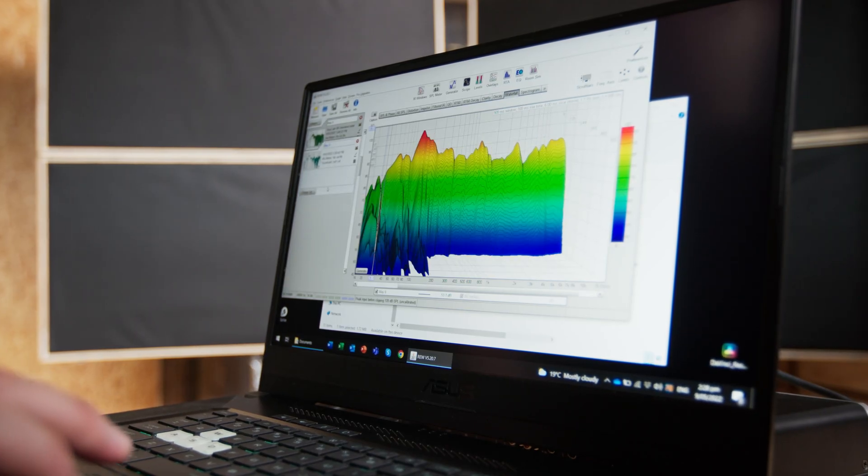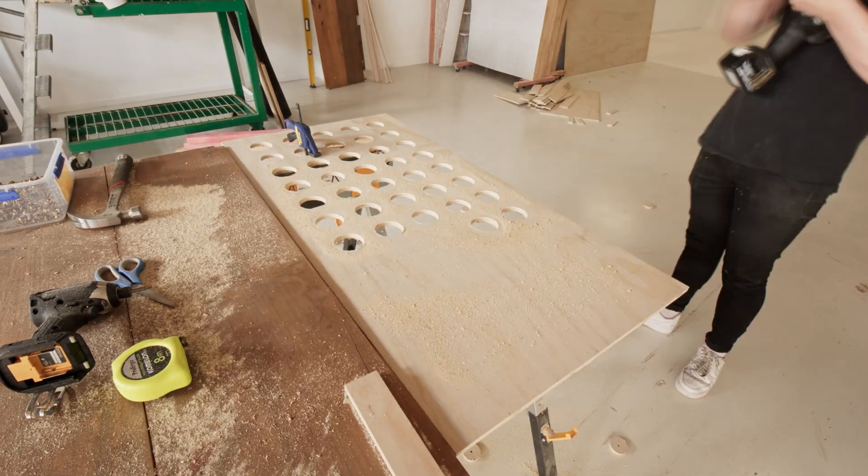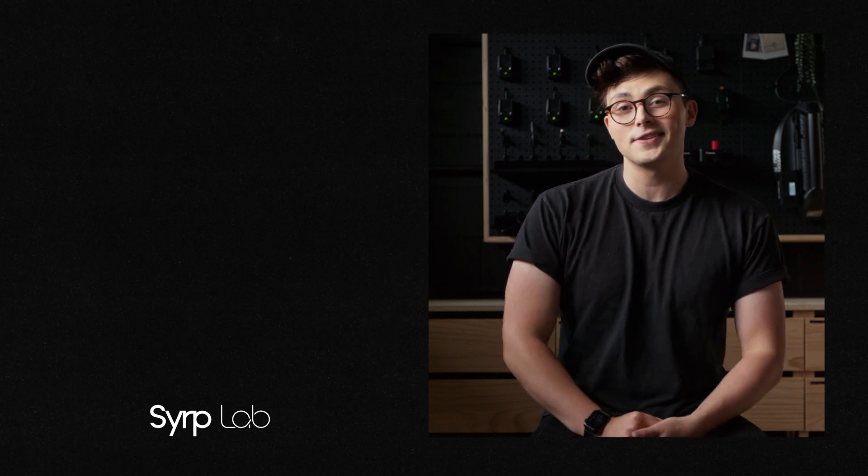So this is what it sounds like in the room without any sound treatment. And this is what it sounds like with all the panels in the right place. When you listen to voice in this room now, there's definitely still a bit of reverb in the bass, and we can see that on the waterfall graph. But with a limited budget and how fast we did this, there is still significant improvement. Is it perfect? No. Is it much better? Definitely. If we were at 20% before, we're at 80% now — and you're definitely in that range of diminishing returns where you'd spend a lot of time and money making it perfect. For us, not being audio perfectionists, this is probably good enough. If you'd like to build some panels of your own, we'll put a PDF of our plans up on the blog — you can find the link in the description below.